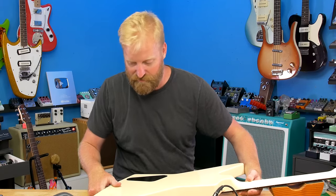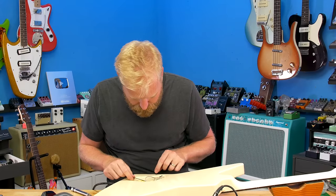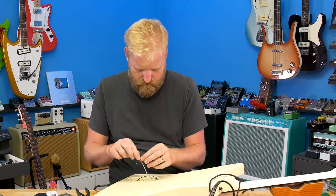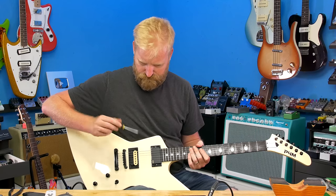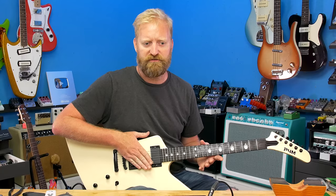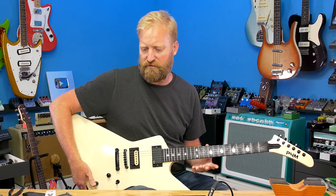Let's open it up and see what I messed up. I would have noticed if it wasn't grounded before. I'm going to try swapping that green for the black. These things are never as easy as I want them to be. Pickup works the same — I'm still getting a buzz. It's a weird little surge in the static when I press the strings. If I press the cable and ground that, the buzz goes away.